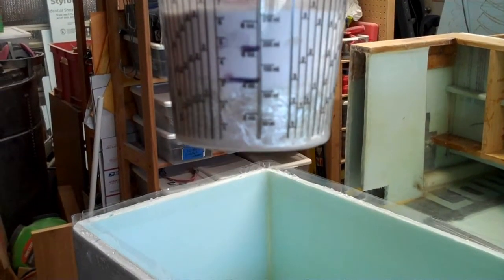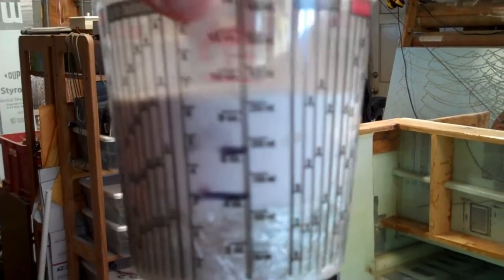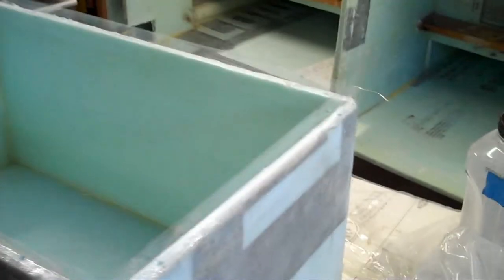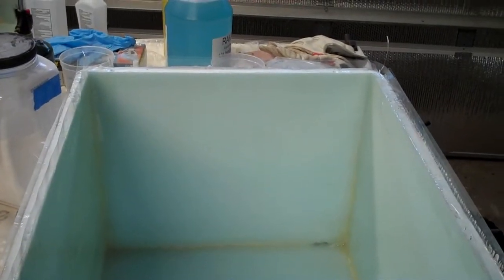The filler material I've decided to use: 4 ounces by volume of chopped fiberglass and about 5 ounces by volume of glass beads on top. I'm going to mix up 6 ounces of epoxy resin, mix this all together, and hopefully it'll be runny enough to pour in. I'm going to put it in a ziplock bag, cut a corner off, and squeeze it out so it doesn't have to pour exactly - it can be squeezed in and flow. I figure I'm probably going to have a lot more than I really need, seeing as how the filler material is almost as many volume ounces as I calculated I need. Any extra I'll squeeze in around this horrible-looking joint down here just to smooth it out and add a little structural strength.